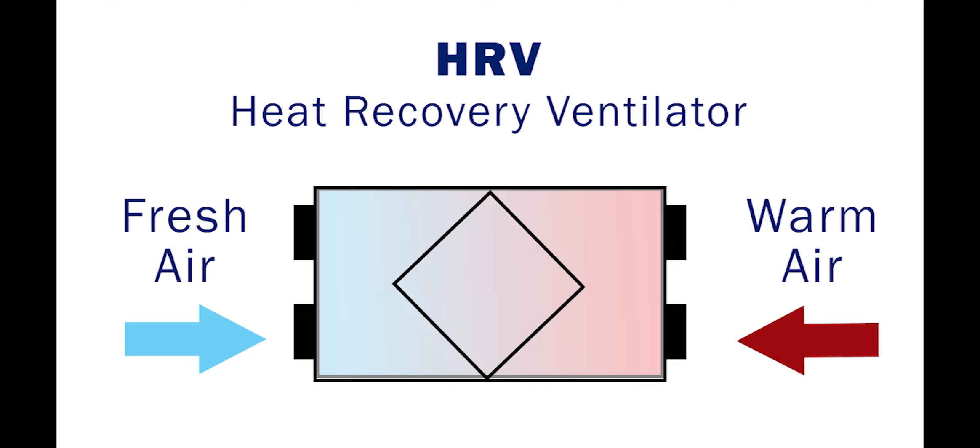In the wintertime it's a different story. Outside we have cool, cold air — not very moist — and so your air inside becomes more warm and stale and moist. You want to remove that air, and that is what the HRV does. It takes fresh air from outside and removes the stale air from the inside.